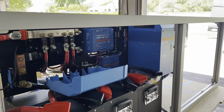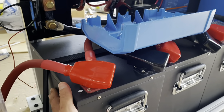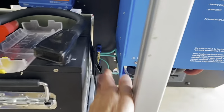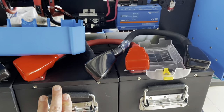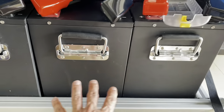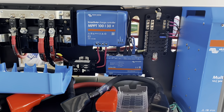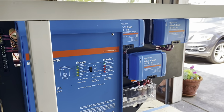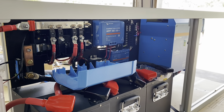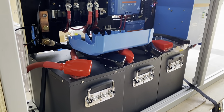This is basically ready to go into the van. One last thing: for attaching the batteries and making sure they're not moving around, I've got a battery strap that comes across — really good for the first and third battery. The second one will wobble a little bit, but I'm not too concerned. I designed this so it was really tight, so there won't be a lot of shifting and stressing these connections over time. This is how we're doing it for our van. And if I haven't been clear enough — if you don't feel comfortable doing this, please get an expert. This is something you really want to take very seriously from a safety standpoint.